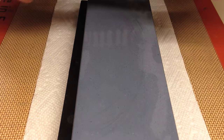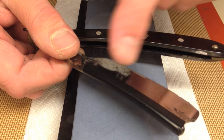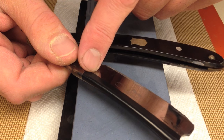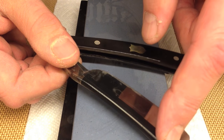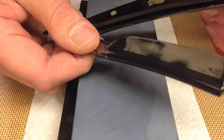This is a big blade, measures about 15/16ths up at the toe. I'm going to lose dimension on this, but that's fine. I put a layer of tape on here because it's a heavy grind. I know I'm going to be pulling the edge back. I'm not certain I'm going to have an ideal bevel angle when I'm done. It was honed originally without tape. I could see the flat up in the spine, but it seems to be polished over, and the blade in general has an awful lot of shine to it.